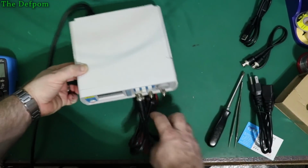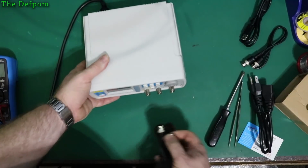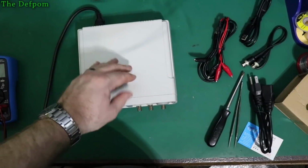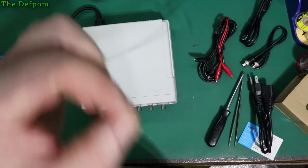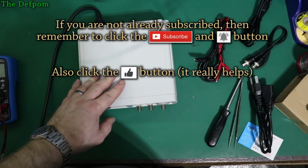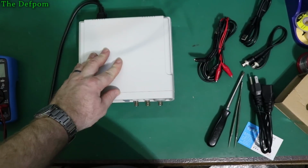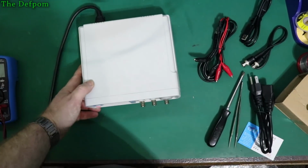It is hard to get a DDS signal which isn't noisy like that, because they are made out of pulses. So having lots of pulses means you're going to have noise. It's a pretty good waveform if you look on the scope. It looked nice on the scope, but your ears are much more sensitive than that, and you can hear it. That humming is a sign of the pulses in the DDS affecting the VCO frequency. That's one of the symptoms of using a DDS system, which is why they're generally not suitable for radio stuff. But it depends on what you're using it for. It might be adequate for what you're using it for.